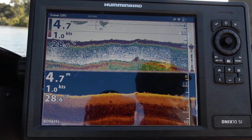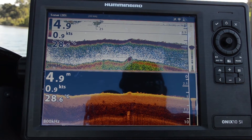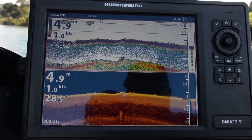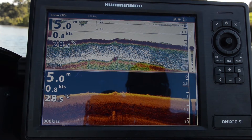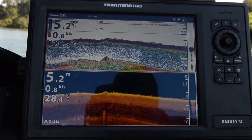We're highlighting quite a large area of the bottom, whereas down imaging is still wide left to right, but front to back that cone is compressed — it's only three or four degrees. So we're taking tiny snippets of very high accuracy information to build our image, giving us a really sharp, detailed picture of the bottom.